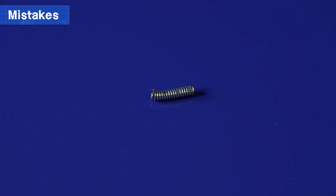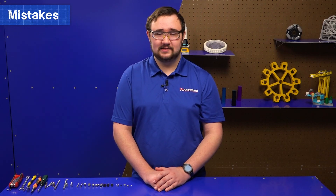If the screw is in a counterbored or countersunk hole, things can get significantly more difficult. In very rare cases, the head of a bolt can be completely sheared off, leaving only the threaded section of the screw behind. This will again vary by situation, and it is difficult to suggest a primary method of removal in this case, but the vice grips method we talked about before may work.